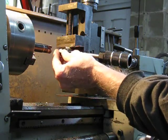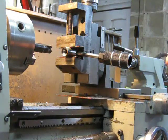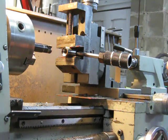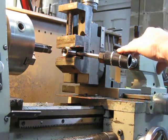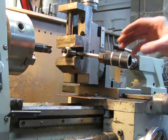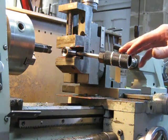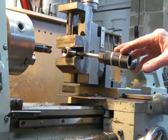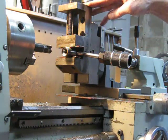That will go into there — I've partly bored it out. I just thought I'd show you, while I'm doing this, the best way to do these sort of jobs if you're using a vertical mill slide. In this case I can't disassemble this because it's all locked and tied together without heating it up, so I'm just going to centre bore it with a handle on it, using the vertical mill slide.